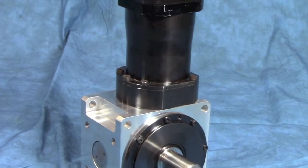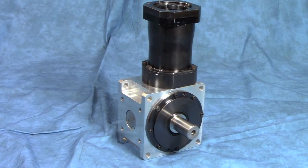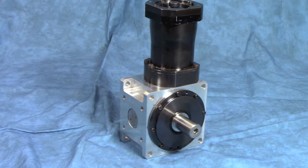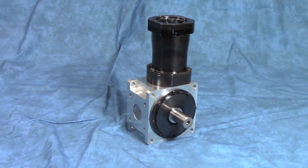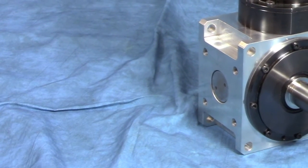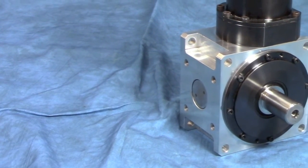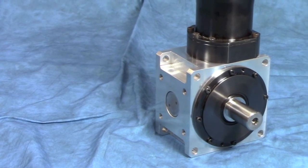The final box we want to take a look at is the Tandler Servo Hypoid. In brief, a hypoid is an offset spiral bevel gear where the axis of the spiral bevel gear and the axis of the output ring gear do not intersect and are offset. By having this geometry, we can achieve higher ratios from 6 to 1 up to 15 to 1 in a single stage. With other designs it requires two stages to get to these ratios, but with the Hypoid it's achieved in a single stage and is thereby far more cost competitive when these are the target ratios.